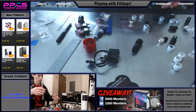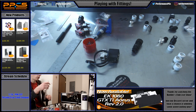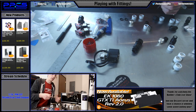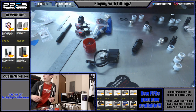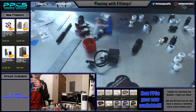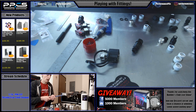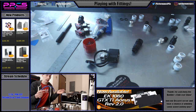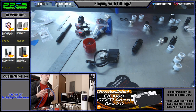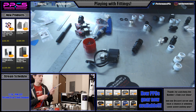If I were ever to do it again, I would have another person to sit there and use two heat guns and heat the tube with me and hold it and let me wrap it. Either you need to make some kind of a mandrel so it can hold everything for you, or you just need a friend. After I tried it, I got it to wrap twice, but what I found out is that even with my Alpha Cool insert here, which is probably one of the loosest inserts, this is 12 mil ID, you can put it in without even water on it. I can bend fine with this. However, when I wrapped it, it just got so tight around the insert that I had to cut the tube off it in like six places. I could not get the insert out with anything. I put soap in there, olive oil, sat there with water just running through it, and it would not come out.